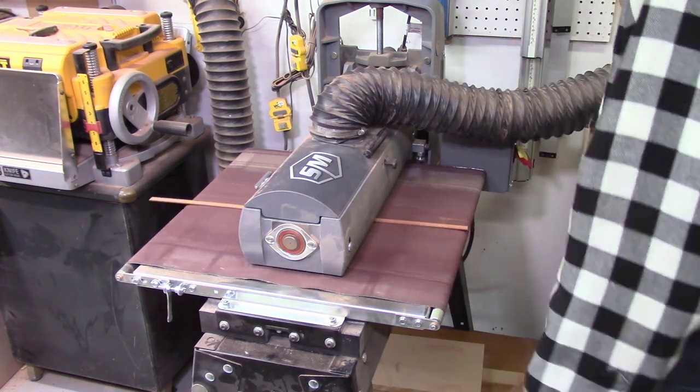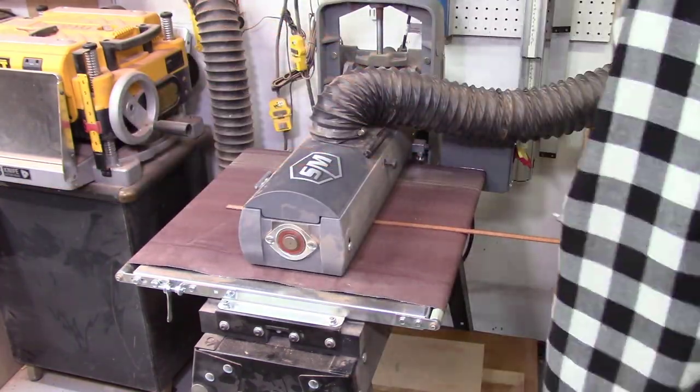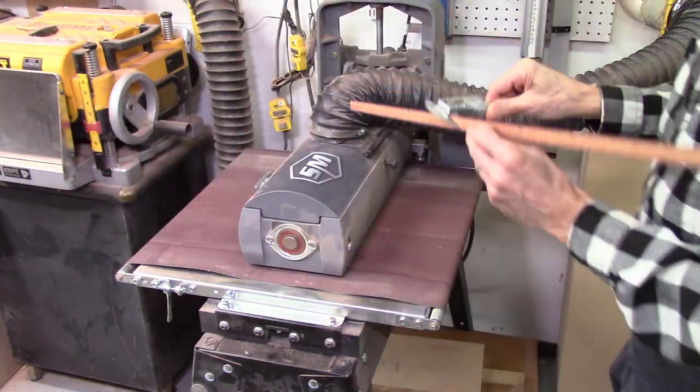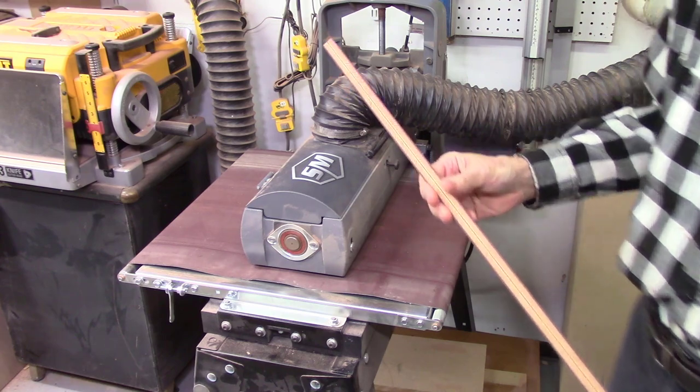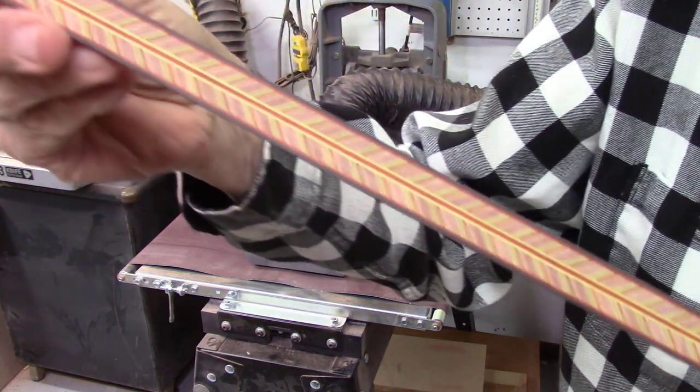I have my board sander set to a thickness of about 50 thousandths of an inch, and I run the strip through the board sander on both sides without changing the depth on the sander — taking off maybe one or two thousandths just enough to get rid of the burr and smooth out additional saw marks. And this is the finished inlay strip with the herringbone pattern.